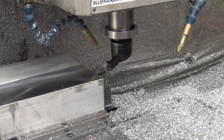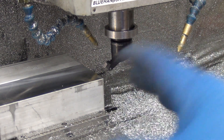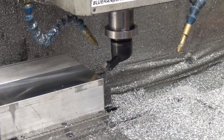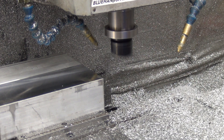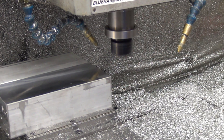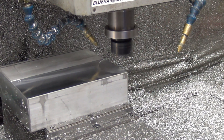If that's the case, I'm gonna do it one more time from left to right, because that way the leading edge on the right side should do the full depth of cut, and the left side should just float — it shouldn't touch anything because I have the head tilted that one thou. I'm not gonna do it with any coolant, just to make it easier to see. And that's 25 inches per minute.